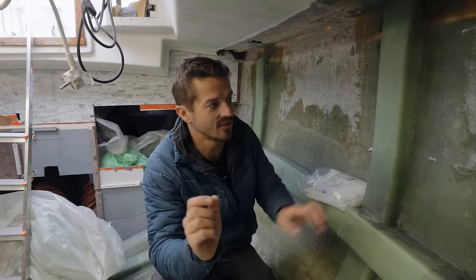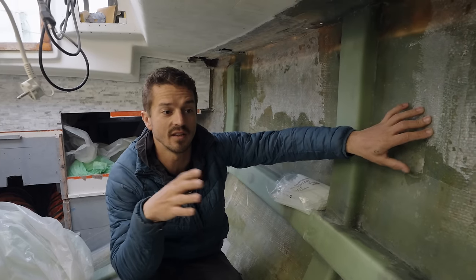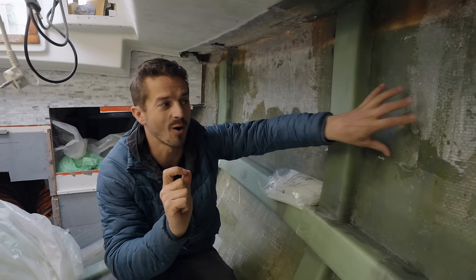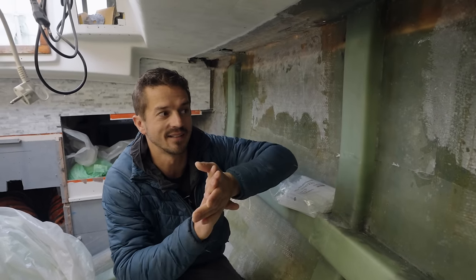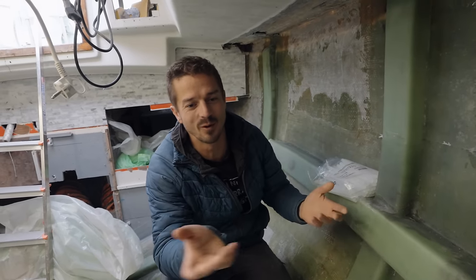And that 2 mil of biaxial is about the same thickness that they're using on the interiors of new boats with a foam core. And so our whole entire one centimeter thick original fiberglass hull is basically acting like the core. Like the mold. That's just like the mold that we're going to take with us.